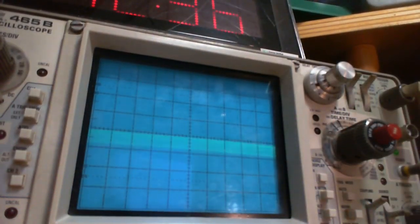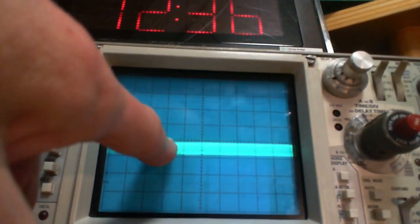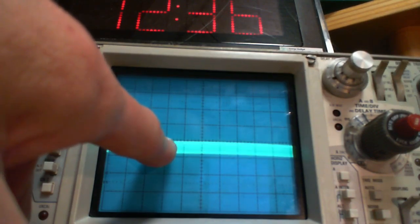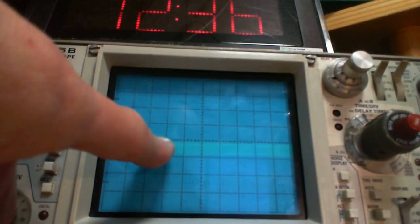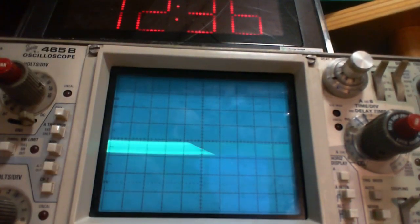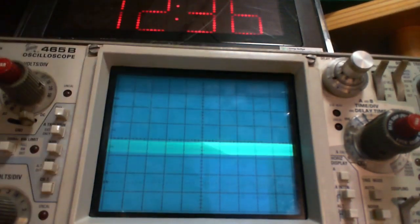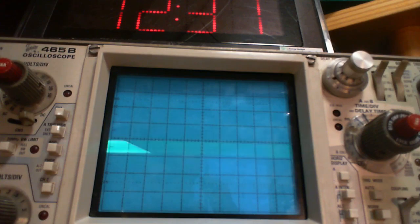So this guy's job is to snuff RF, and that would look like an RF voltage right here. I'm trying to snuff this with both a great big 20 microfarad and this 0.1 that we're hooked up to. That probably shouldn't be there. So I can repeat the same experiment just by taking a 0.1 capacitor. I'll do it with a 0.1 this time, and we'll just parallel it.